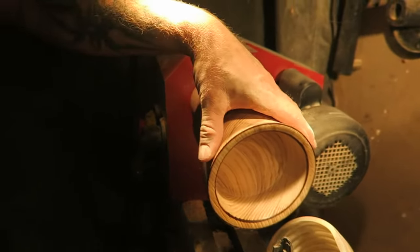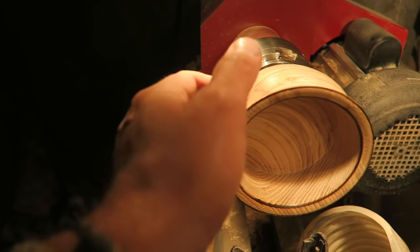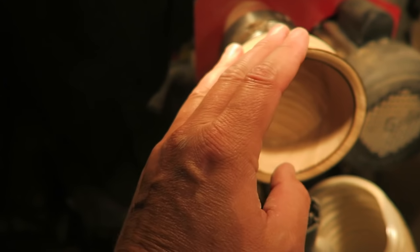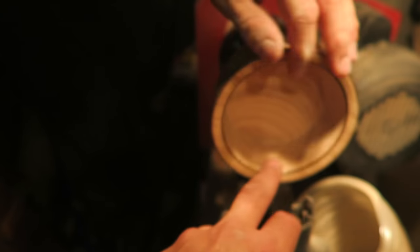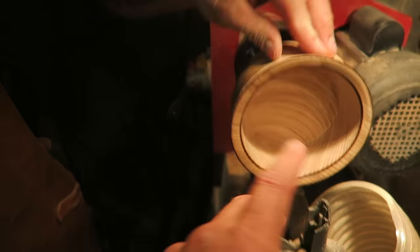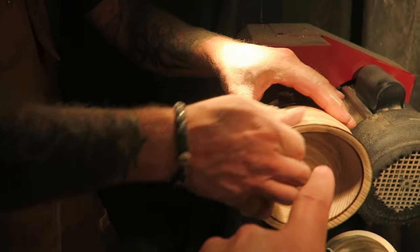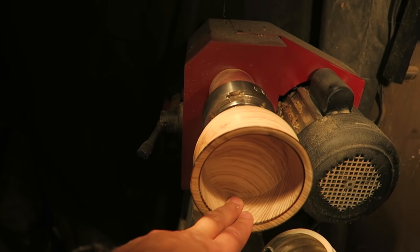That's a nice bowl. The thing is, what I normally do is I do that burn right at the end. Once I've sanded everything down to how I want it, I then put the burn in. The problem is because we're still moving down in grade of sandpaper, we've done it too early, exactly. We've peaked too early. Let's just do that again. I mean, let's sand it all down the next grade. There's maybe two more grades to go.